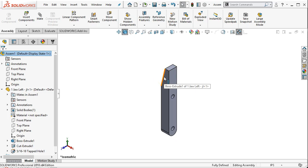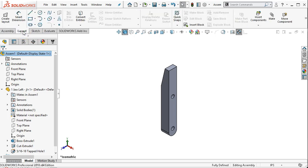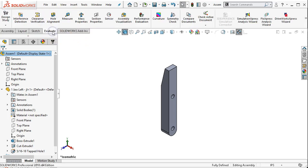I'll move that into position. We're going to start accumulating blue dots for all of these origins, so I'm going to turn the origin off now that I have the first piece in position. Things to notice about the assembly: we have an assembly tab. We can still sketch but we're not doing anything in the way of features. Layout is another tool we can utilize in the background of the assembly. We can pick up measurements between geometries as well as mass properties and center of mass once we start to apply materials.